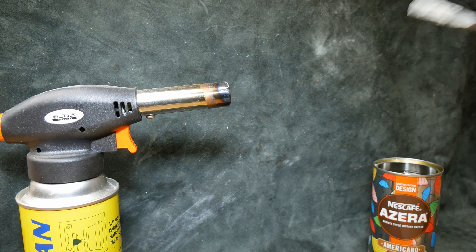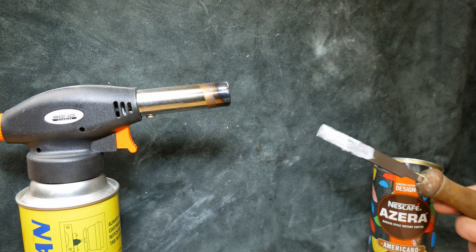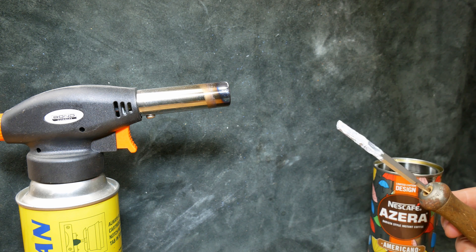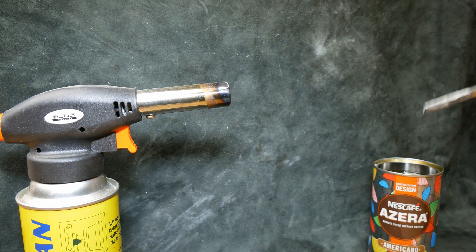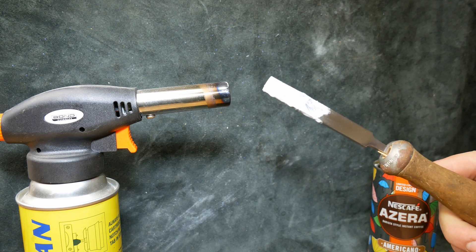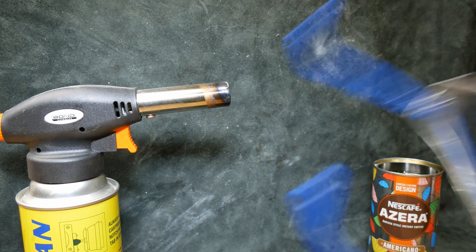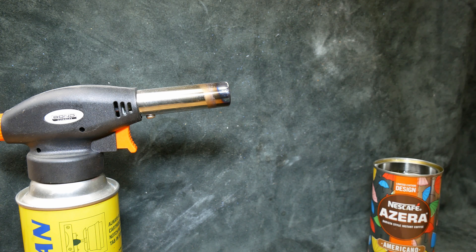Okay, we're ready to go. I've got the end of the tool covered in soap — as I said, we're just doing the tip. We've got some engine oil here which we're going to be quenching the tool in afterwards, because we don't want to cool it down too quickly. We've got the blowtorch ready to go — hopefully it's good enough to do the job. I've got all my safety equipment on and I'll be throwing a set of gloves on. So let's crack on and see if I can do this.